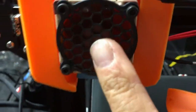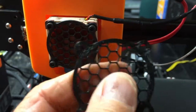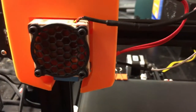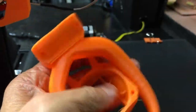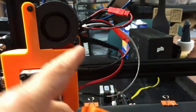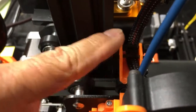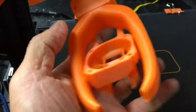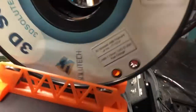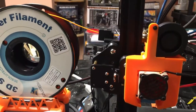I'll have a 40 millimeter fan mounted on top of this. I printed a little honeycomb fan cover from Thingiverse — I once stuck a screwdriver through a fan, so the cover is useful. The fan will be mounted on top, the blower fan will be in the back, and everything else stays the same. I'll need to figure out wire management to keep everything from bending and wires from eventually breaking. This print is very solid since it's ABS. I'm using a good-priced ABS off Amazon — it always works for me.